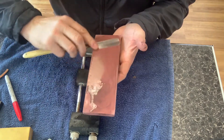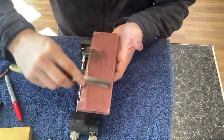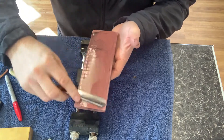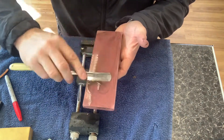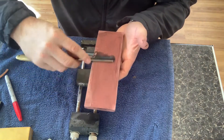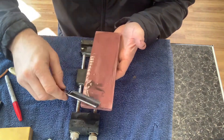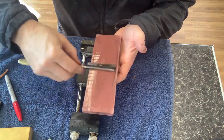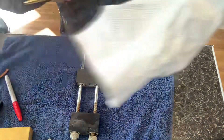You can imagine that was a wheel going around — this is what it would be like. I don't really know all the science behind this, but I'm just keeping it simple. I just know this shape is going to convert the shingled bevel to the concave bevel, and that's what we're wanting — just back-beveling that bevel, thinning it out, making it as thin as we possibly can. Perfect — I can feel that that's done.